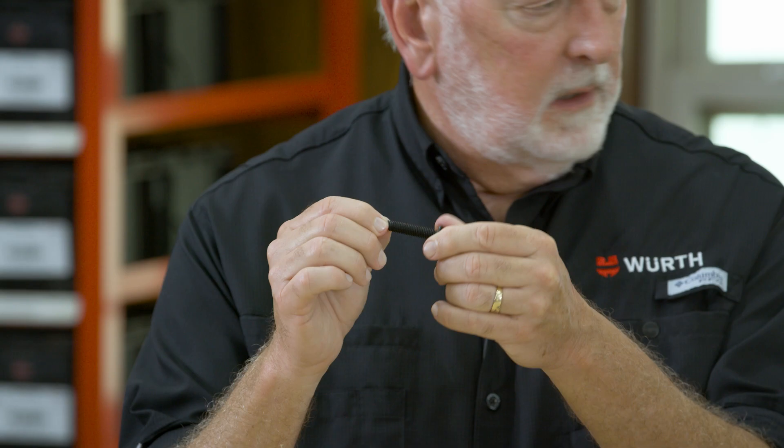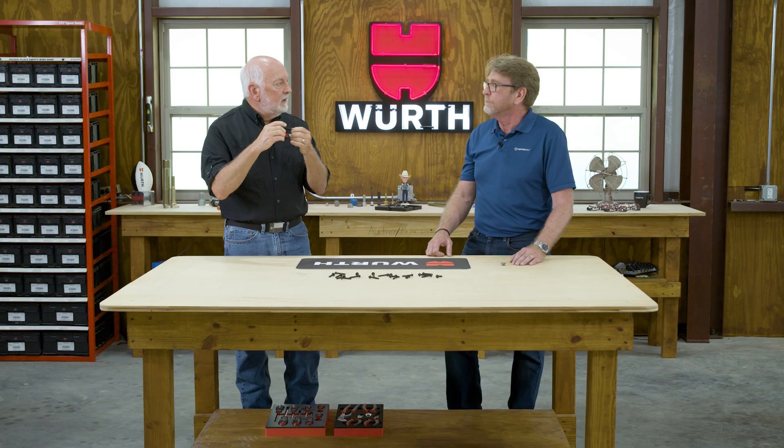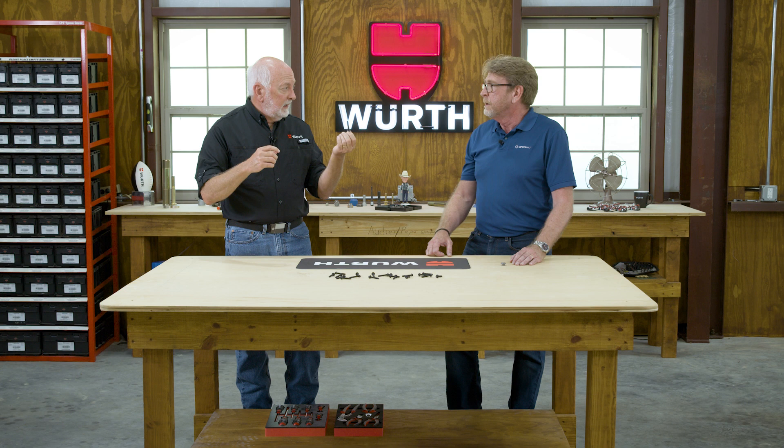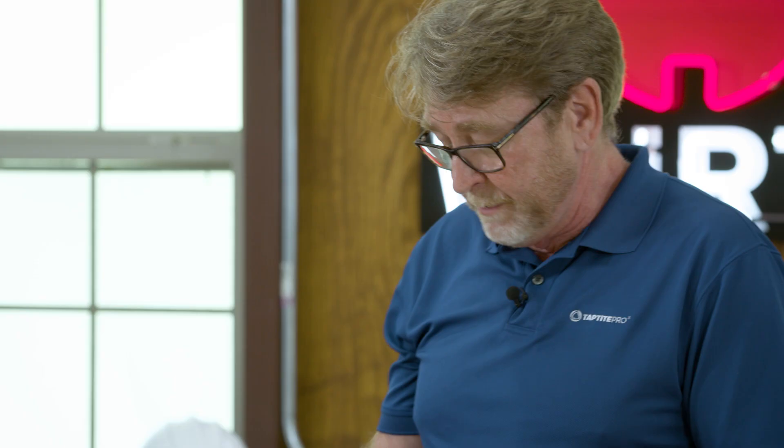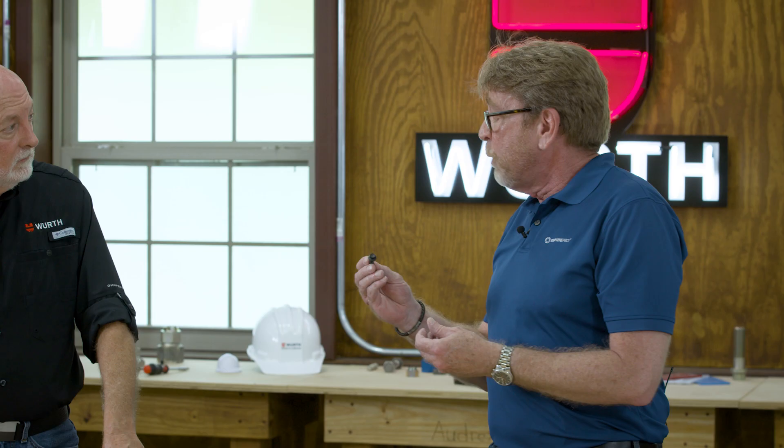Notice the taper and up in the body you can just feel that trilobular shape. So as you said, more 360-degree engagement, greater shear strength, greater pullout resistance. Traditional generic fasteners will have one out-of-round shape or trilobular shape that goes the full length of the fastener. The problem with that is you have less strength in the nut member, so you tend to strip the fastener.